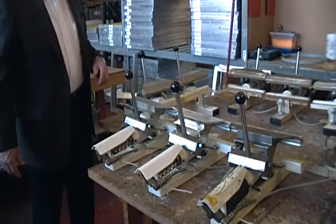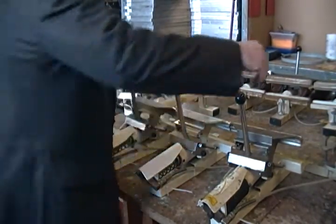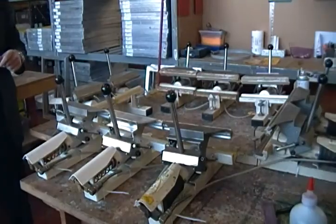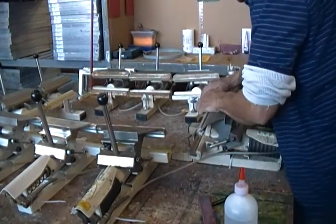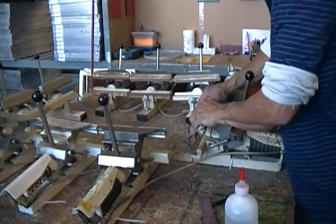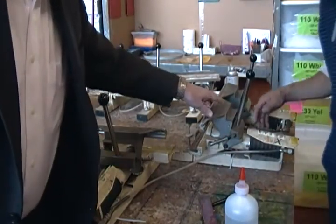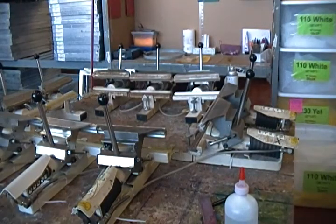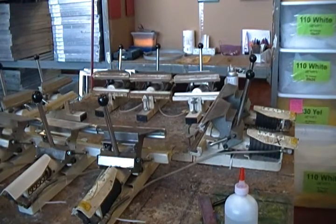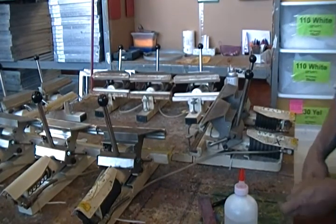As you're inspecting before you start the day, you inspect to make sure that your urethane is all put in the correct place and that your stretching device tightens it. As we know from doing an earlier screen, the urethane dowel rod on that clamp needs to be adjusted and pushed up inside. The jaw strength is adjusted by putting an Allen wrench into the screw hole and tightening. We know that this unit was loose, so we'll go ahead and tighten this one. Anytime the clamp moves during the stretching process, that means the clamp will have to be adjusted.